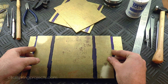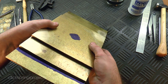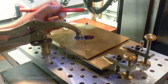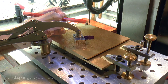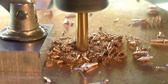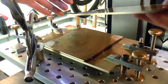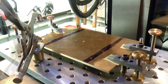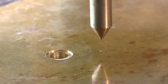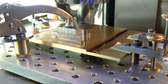I can now work with the plates aligned in a complete stack like this, or in various combinations as required, and be confident that the relative positioning of features will be accurate across all 4 plates. In fact the next operation is a great example of what I mean. I used a wiggler to pick up the center bearing position, and then drilled out the main bearing hole with just the top 3 plates registered together. The upper 2 plates were then removed to permit a light countersinking of the main bearing position, and also the marking out of a key arbor position. The subplate was then returned to the stack to pick up the correct position for the pillars, and finally the front dial plate was also returned to the stack to drill out the pilot holes for the pillars.